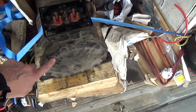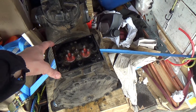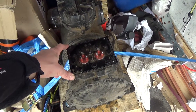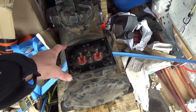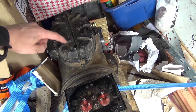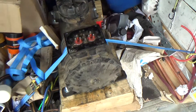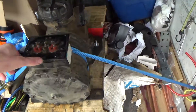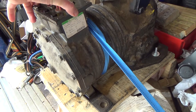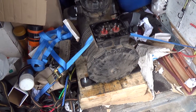The main reason you'd want to find out why it failed is if you've spent good money on a new compressor and there's a problem with the system. Maybe it's flooding back, or even if it's the opposite — if it's undercharged or the expansion valve's not feeding well and you've got stupidly high superheat. High suction superheat leads to high discharge superheat and that can end up carbonising the oil and cooking everything in there. So it's good to know what killed the old compressor. This looks like it could be just wear and tear and old age — it's about 20 years old, P-reg, I think is '96. So it's probably done a lot of hours — this is probably just old age.